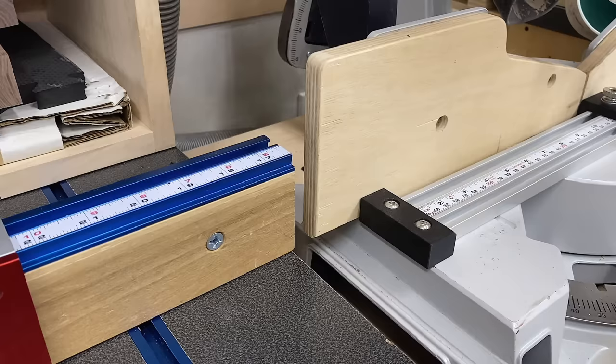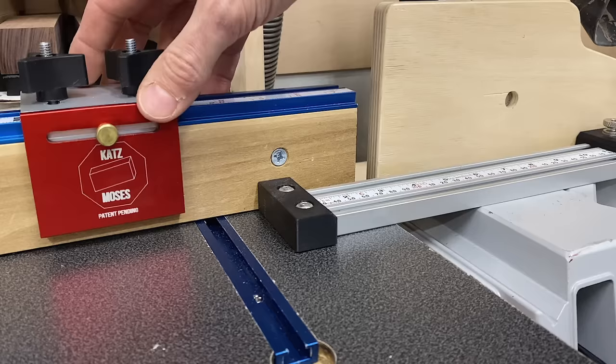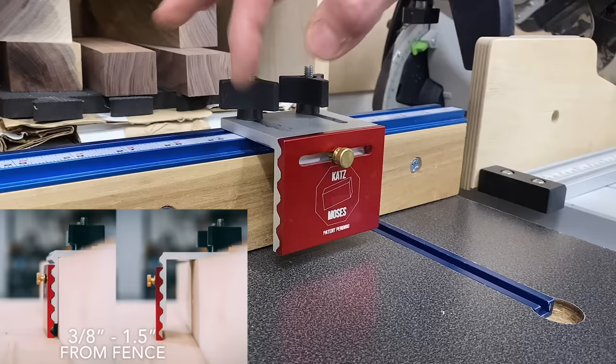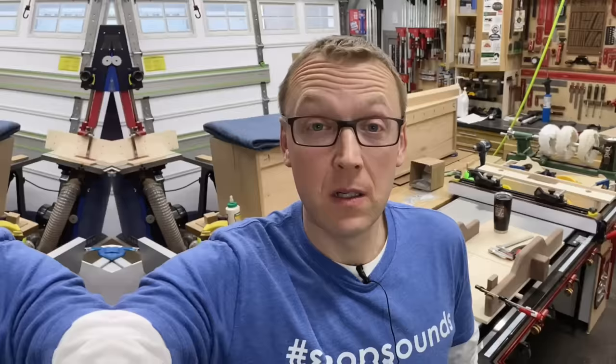Since my fence starts further out, I'm at a disadvantage on shorter cuts for now. What I would typically do is bring a stop block and clamp it to my fence. Once I get the longer rail and I'm working with longer stock, it comes out here, comes in contact with my fence, and the Jonathan Katz-Moses stop block is waiting to create the production stop I need. One of the great features of the JKM stop block is it can extend almost an inch and a half away from the fence and still be completely accurate with zero deflection. Another great feature: if you unscrew one and turn the stop block to 45 degrees — use a combination square head to confirm — you're now set up for a production run of cutting moldings or casings. You cut one at 45, put it against the stop block, and make sure all your lengths are exactly the same.